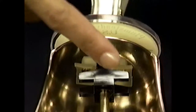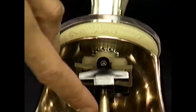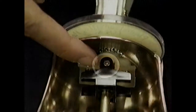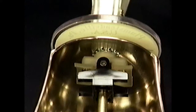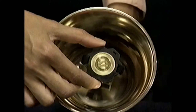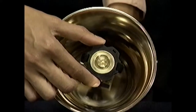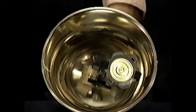The yoke, which is made of nylon, pivots on the tapered heads of two stainless steel self-locking socket-head bearing screws, which are visible on each side of the yoke. As with all bearings, continual use will eventually create wear, resulting in looseness and objectionable noises. Occasionally, in new bells, some bearing looseness may develop after a brief break-in period. In either case, readjustment is quick and easy thanks to Mallmark's exclusive design.